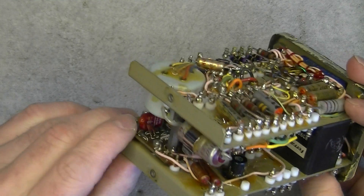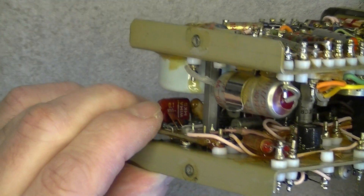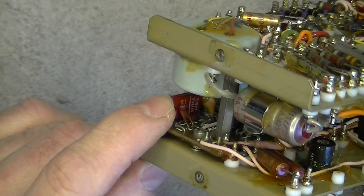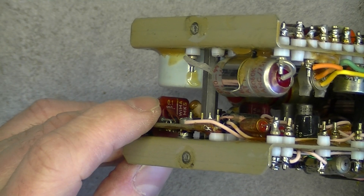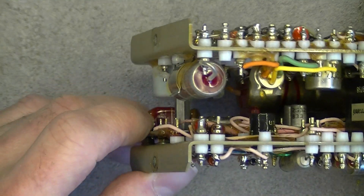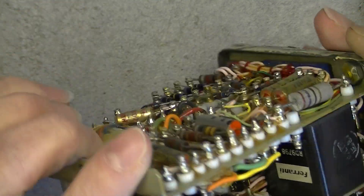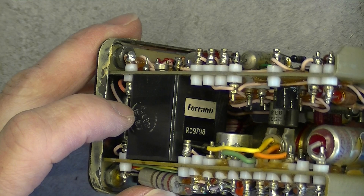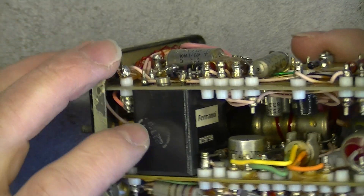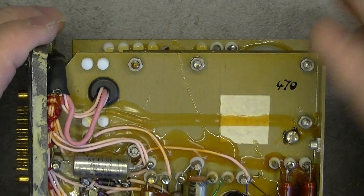On the circuit board we have a fairly common German-made WIMA capacitor. This is not a military grade or aircraft grade part - it is a common type of 70s era capacitor. I actually remember one in a controller for a toy train I had when I was young. There is also a stud-mounted transistor here. The Ferranti box might be a magnetic controller for synchro resolvers or something similar. It seems to be a potted box with 10 contacts, and there are a lot of unpopulated spare spaces.